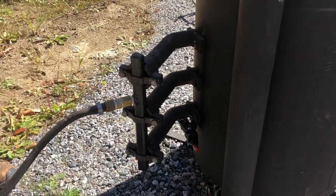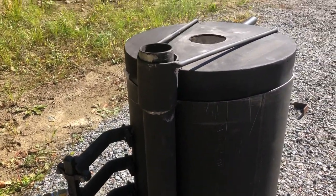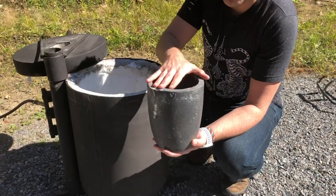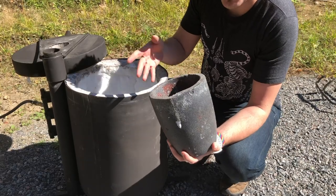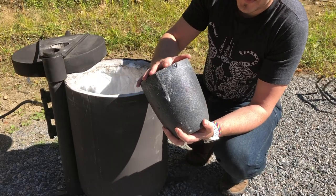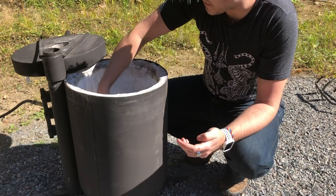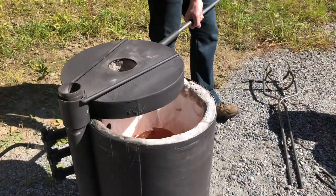I think three is more than okay. In one of their forges that I have experience with, these forges will easily get up to about 2200 degrees Fahrenheit, which is more than enough. This is the size crucible that we're using — this is about as large as I can get from Geswin. This is called a bilge crucible and it's made out of a graphite clay. This will easily fit inside here with plenty of room, and at the moment we're going to be melting aluminum.